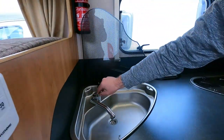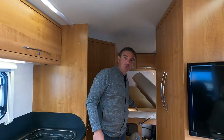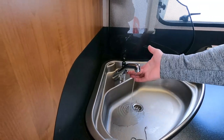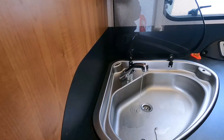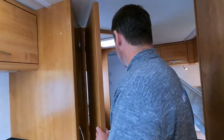Make sure all the water is out of the pipes — drain everything down. Then keep pulsing the pump; it's a SHURflo pump and you won't harm it running it dry. Just run it to push any remaining water through the pipes. Once it's fully drained, leave the tap in the mid/open position — it's important to leave it open because any water held in there can split the tap.